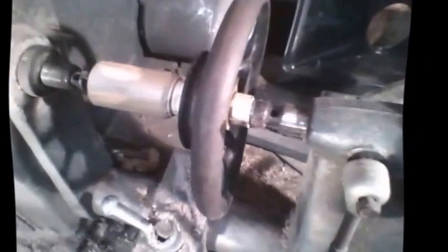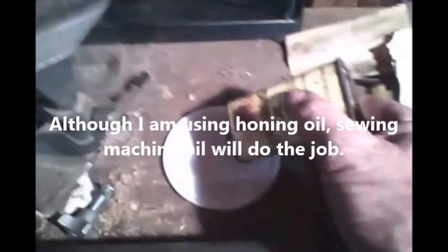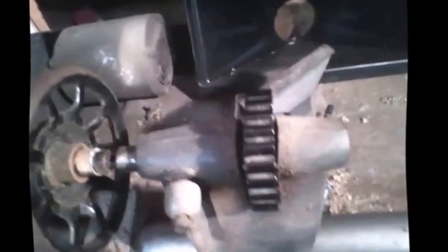I've got the Singer hand wheel on the mandrel in the lathe. I have 100 grit paper I'll use dry, 600 grit I'll probably use dry to begin with, then 1000, then 1500 grit. I've got my honing oil — I like to use it because it does a good job. I'm going to dip my paper in it since I'm doing this one-handed. I'll start up the lathe — it's going to be a little loud. First I'm going to use the 100 grit.